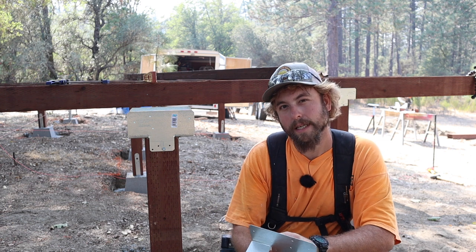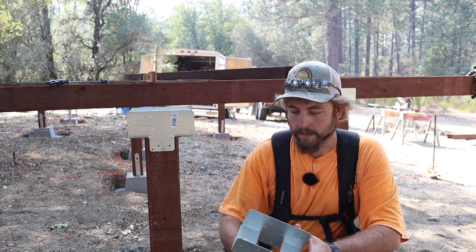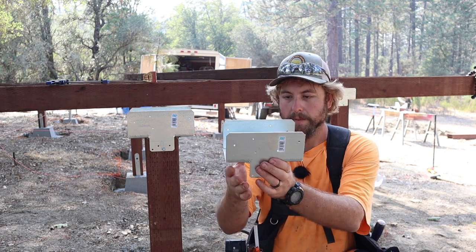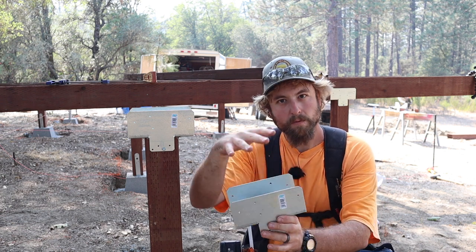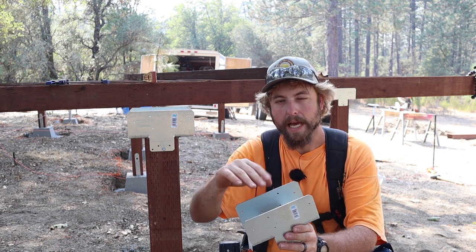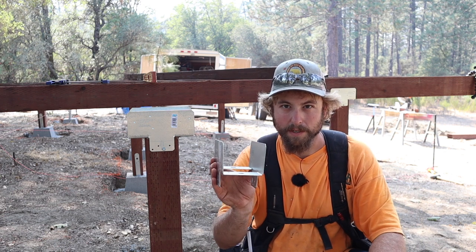And then the Z is a special coating that they put on these brackets that's designed to go up against pressure treated lumber. Basically, it just grabs the 4x4 here, as you can see, and then it holds the beam, any 4x beam. It could be 4x6, 4x8, 4x10, stuff like that. So this is capable of doing any 4x sized material.